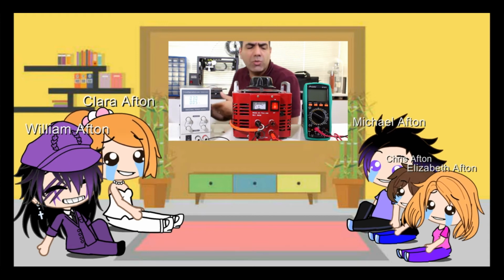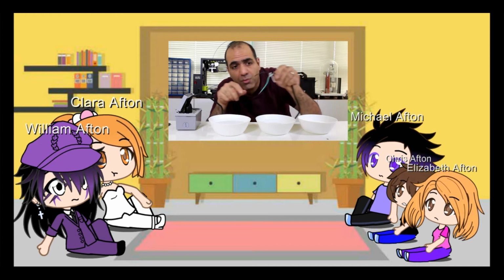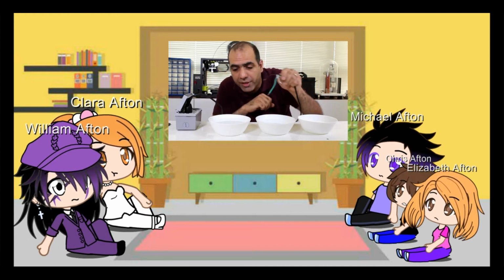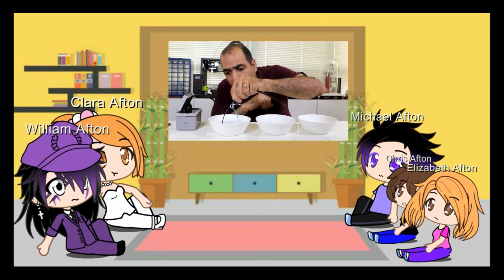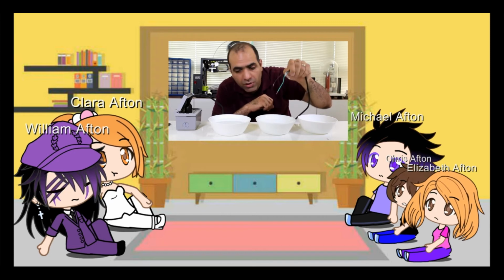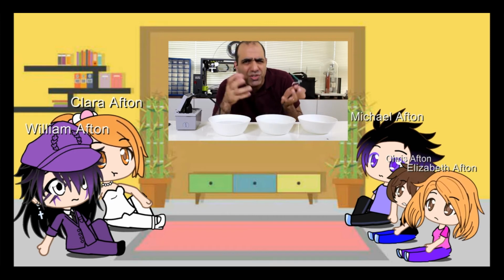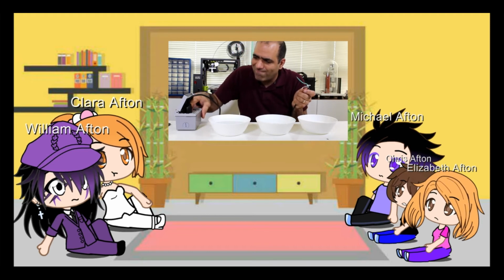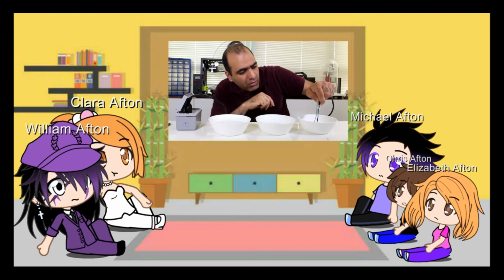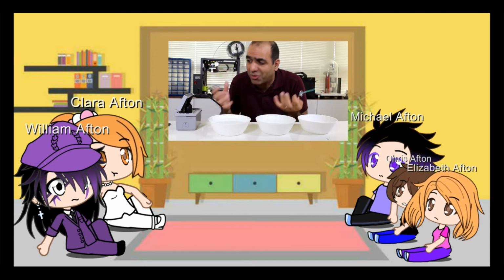Let's experiment a little bit with water. I have cold tap water, hot tap water, and soapy water. And I'm gonna put the live and earth wires in each one of them to see which one triggers the breaker. Starting from cold. This one doesn't trigger. Hot water. Okay, that one pops, which means that there are more chemicals in the hot tap water, so don't drink it much. And now the soapy water. Oh, definitely. So good news everyone, if you are in a warm shower and you drop your hair dryer in the water, the breaker pops.